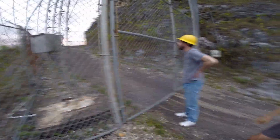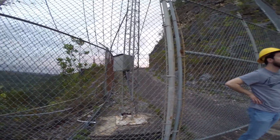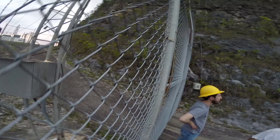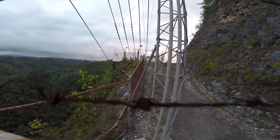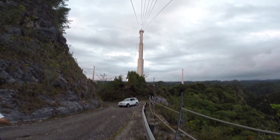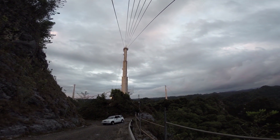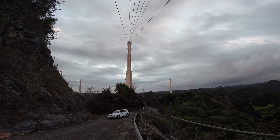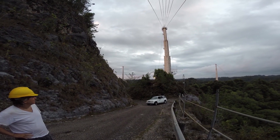Compressed air is being pumped up through the cables. The cables are actually threaded wire rope. One of the early problems was erosion — some of the strands were popping because they were rusting. An engineering guy had the bright idea to pump compressed air through the thing. It's not dry air, it's just positive pressure, so that water doesn't seep into the thing. They paint the outside of it, but if anything tries to get in, the pressure pushes it out. Since then we haven't had too much trouble with rust on the cables.